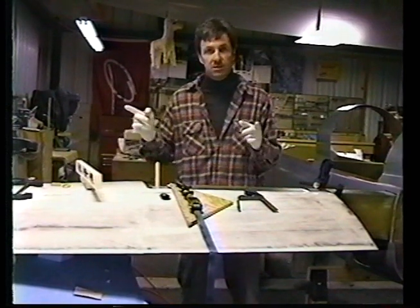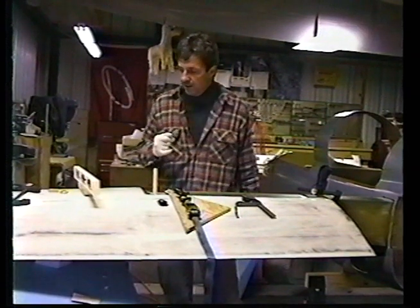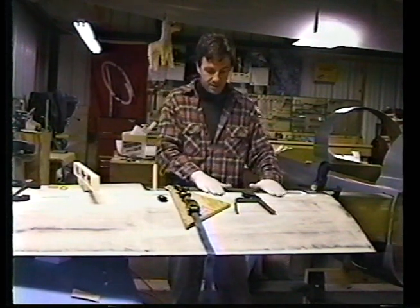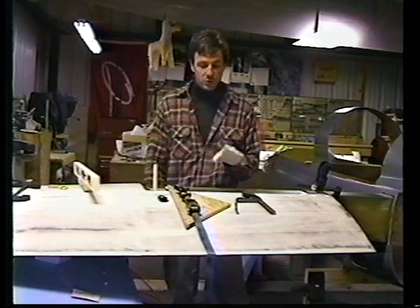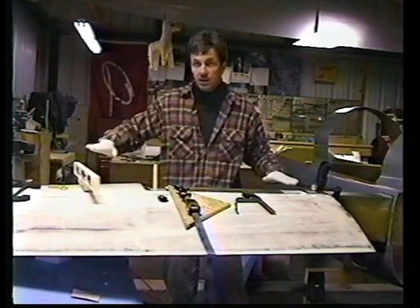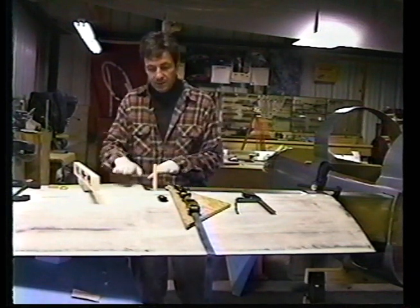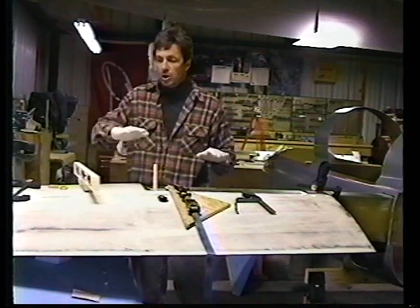It's got to be zero set on that water line when the fuselage is set at level. Now I've got a strake that sits on top of this spar that's supposed to mate to the upper surface of this wing, and I've got a strake that sits on the bottom. The primary difference between the top and bottom is that the top surface of this is pretty much dead level all the way across. So if I have a disparity between the top of this and this surface, where this is very high or very low, filling is going to be difficult for me to average in because it's all flat. I'm going to end up with a long curved bow.